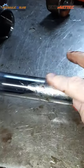Keeping the barrel clean, obviously. First of all, you want to polish the barrel as best you can with sandpaper. What's this here? Oh, the wiper seal. So what's a wiper seal? A wiper seal is prevention of dust and contaminants getting into the inside of the gland nut. How does it do that? It has a light wiper lip that angles down and squeezes on the rod. Just show us how it works.